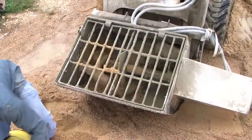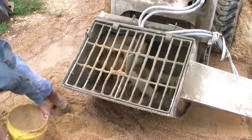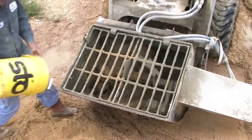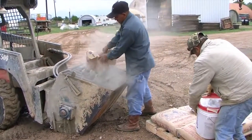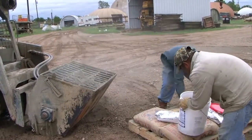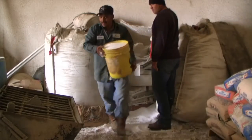Here at Monolithic we're working on some new ideas on insulating EcoShell buildings. The newest one is using Styrofoam beads. We're taking our standard concrete mixer and instead of a 100% standard mix, we're splitting that up into 40% sand and 60% Styrofoam beads. What we're going to get is a very weak concrete, but it should have a really good insulation value.